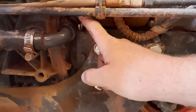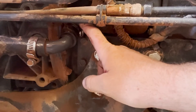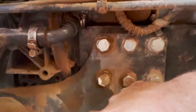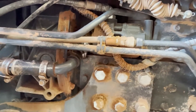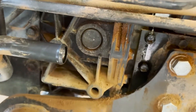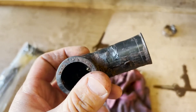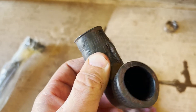So if you have a problem with your tractor's hydraulics — if you feel like your machine just isn't lifting and then all of a sudden your tractor does not go forward or back — look at this area. See if you have oil leaking down here. I'm going to switch this out and show you when I'm done. I've got the elbow taken off, and here's the piece that I actually had trouble with. You can see how that wore out.